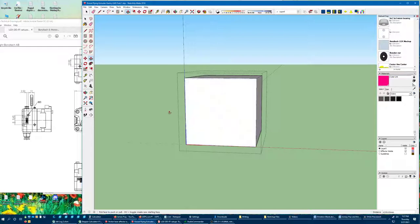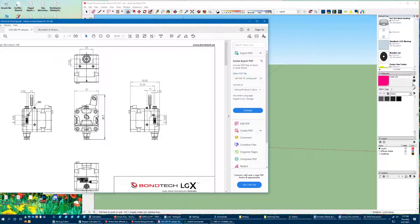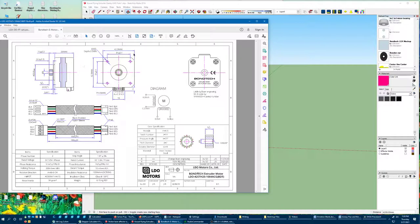Now there is our square face. This has a vertical axis of symmetry, so I will probably go ahead and split it in half to save myself a little modeling time. Looking at this shape, it looks like they have taken some pains to make this plastic gear train housing flow with the size of this stepper motor, and that stepper motor is a NEMA 17. I do actually have the datasheet for that here as well. My plan is to model this profile and just use that across the whole thing.